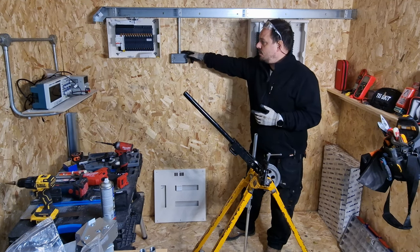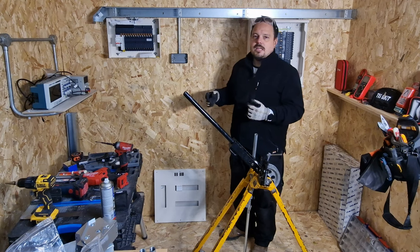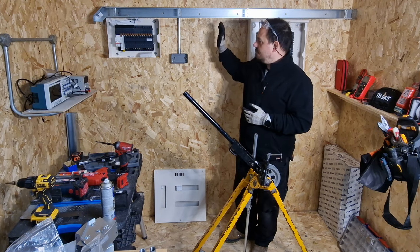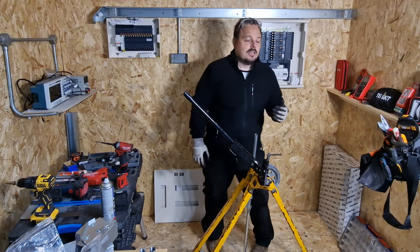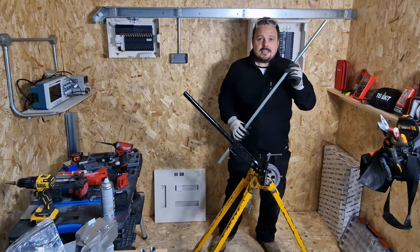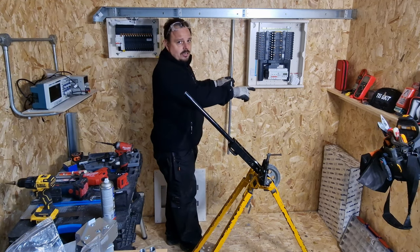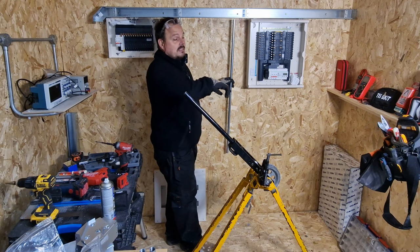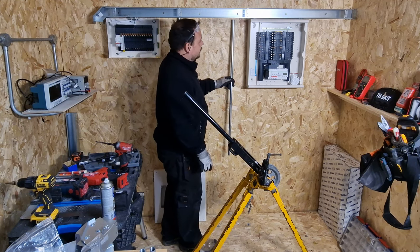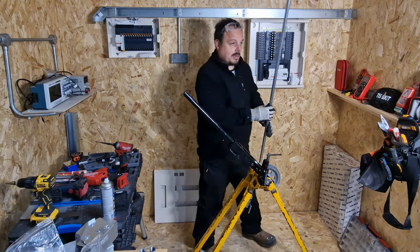This is a Click Scolmore metal clad accessory. I'm using a few different brands just to give people experience of the different fittings and the way they all terminate - wider exposure makes a lot of sense. Now we're going to put a little bend in. I was just going to do a little set but I thought we'd keep it a reasonable length since the idea is for people to come and practice pulling singles through. I'm going to mark here on the wall roughly where I want the center of my bend to be.